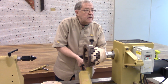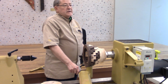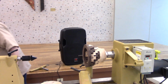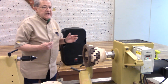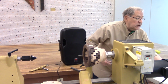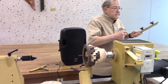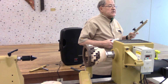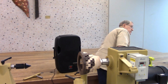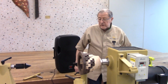So when you make a new layer on that, how do you determine how much bigger the diameter to make that? I've got a whole bunch of waste rings that I use to measure with, and I bought one of these at SWAT last year, and for the size bowls that I make, if I use a 1/16 of an inch difference progression between here, that makes your segment bigger, and it's just the right size. I don't make extreme size changes, but a 1/16 of an inch makes it about what I want.